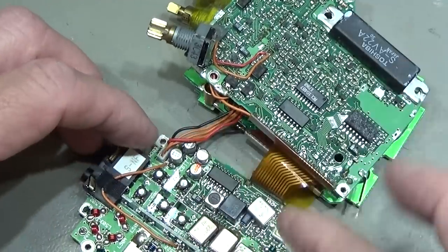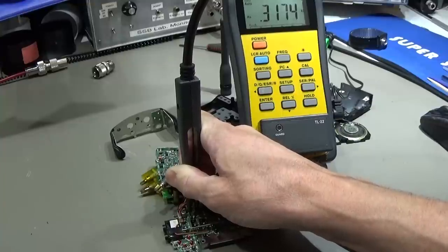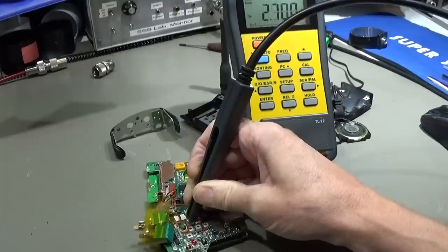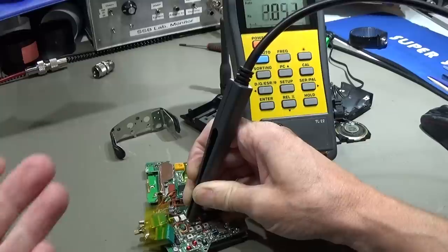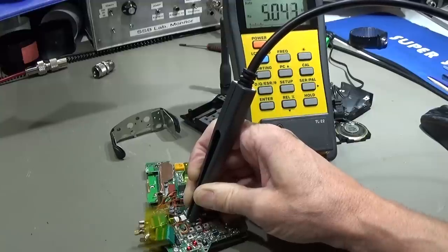So that all is now accessible, and what we need to do, as already discussed, is that our SMD electrolytic capacitors are really the pain here. So, let me give you an impression of the ESR and what you see here. So that is 317 ohm, which is much too high, right? This one, for instance, as you can see, it is 1.6 kilo ohm, the ESR, and you see it is going up, huh? So it is completely dried out, and that is what is creating our problems.